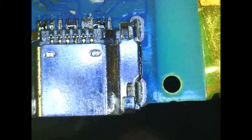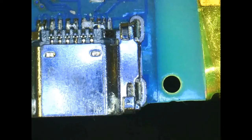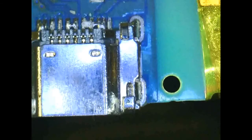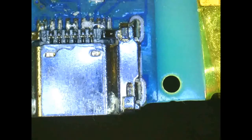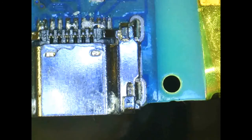I apologize about the video — it's kind of off-centered. I had zoomed in when recording, but the video didn't record zoomed in, so it ended up off-centered. At this point, the solder has been applied and melted, and you can see the bridge connections there — quite a few. What I was adding was some flux to help the solder flow where it needs to. The technique I've found most useful is using an X-Acto knife to try to get rid of this excess solder.